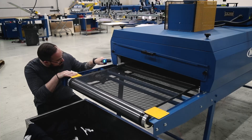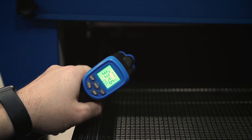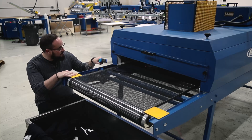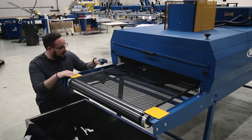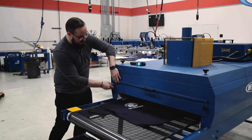Following it now, I've been able to hit 320 to 335 degrees the entire way, which is proper curing to make sure this ink is not going to wash off of this cotton shirt. Looks perfect. Now that we know we hit temperature, make sure once again to lower this gate down for the production run.